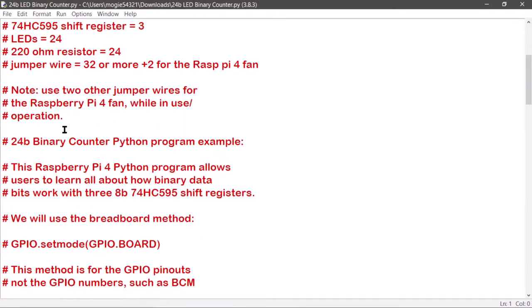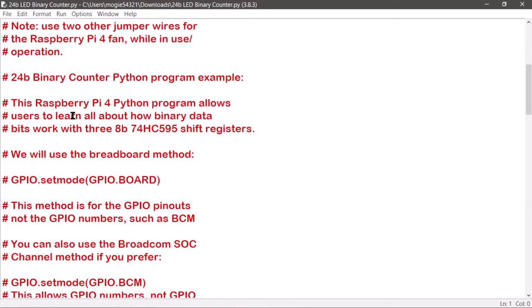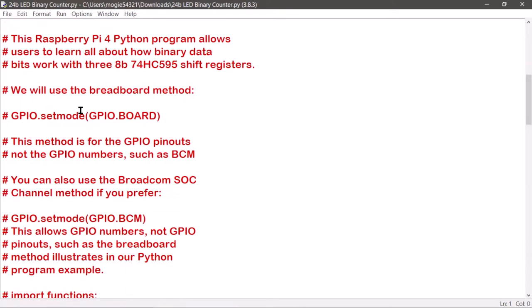And now down here it says, note: use 2 other jumper wires for the Raspberry Pi 4 fan while in use operation. And then down here it says 24-bit binary counter Python program example. This Raspberry Pi Python program allows users to learn all about how binary data bits work with 3 8-bit 74HC595 shift registers. And right here it even tells you what we're going to be doing. We're going to be using the breadboard method, not the BCM. We're using breadboard, which means we're calling the actual pin numbers, not by their BCM number,